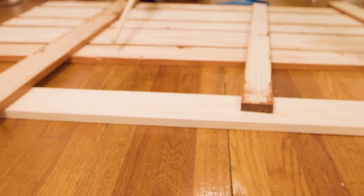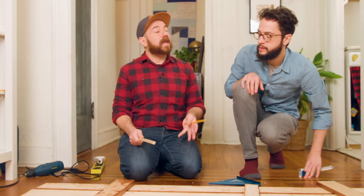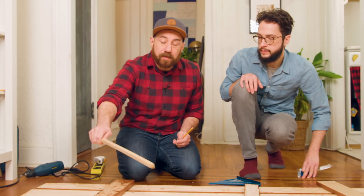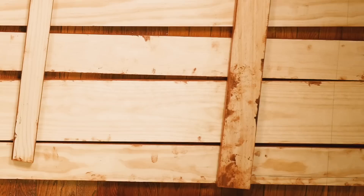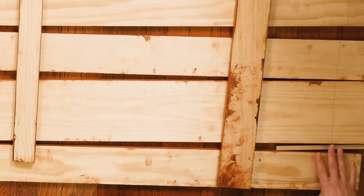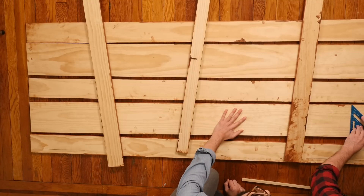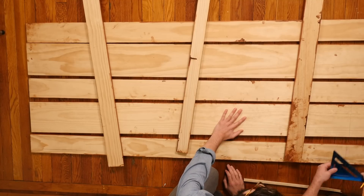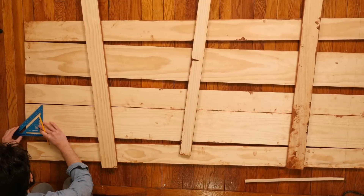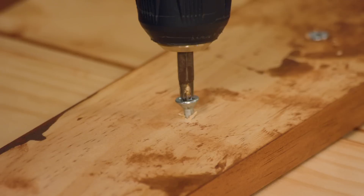We're going to use this piece of wood to help stabilize our post — just slide it right under. We know that we want our headboard to be 50 inches. When we have all these pieces together, it's about 48 inches, so we want to leave about a half an inch between each board. To do that, we're using a little trick — we have a dowel here that's already measured out as a half inch, and we're just going to lay that in between as we go and drill down our posts. Our bed frame is 68 inches and these pieces are 70 inches, so we're going to want extra inches on each side.